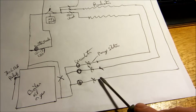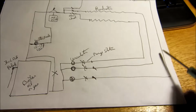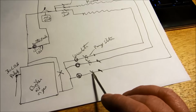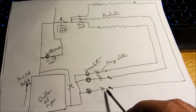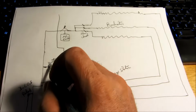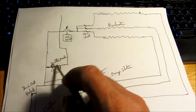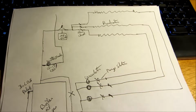And once you get this drain open, all these three are off. So what you're doing is feeding up the supply and then coming back to the return. You can't go back to the boiler because the ball valve's off. And you're going out the drain with the hose. So you would open up this boiler drain purge station, and on the top of this water feeder, there's a little lever that you could flip up. What that does is bypass that 12 pounds and let city water pressure through the zone.